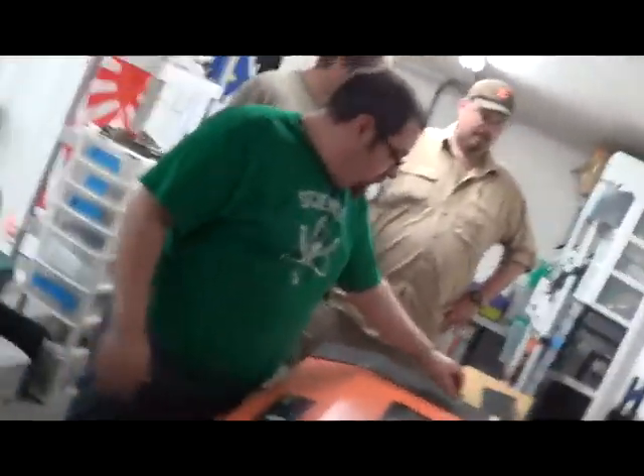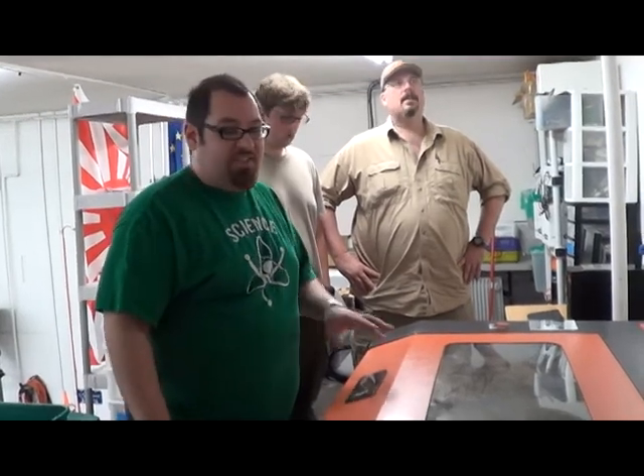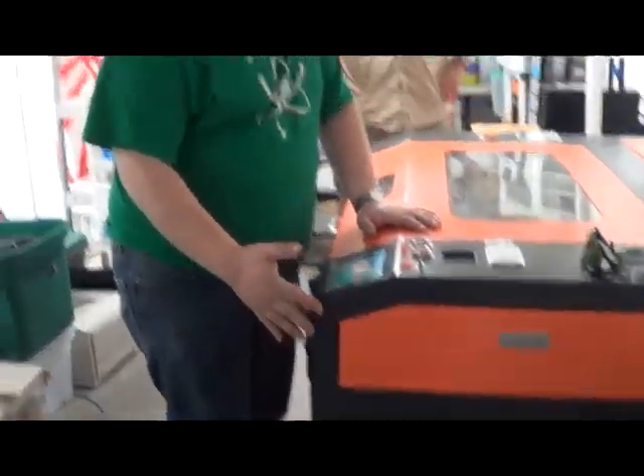Dangerous while we're all up here. Okay, so start out with safety. Obviously, this is a big, dangerous machine. It's got high voltages in it. The tube runs on 25 kV. The high voltages do go all over inside this cabinet, so don't open the side panels unless you have a really good reason and watch what you're doing.